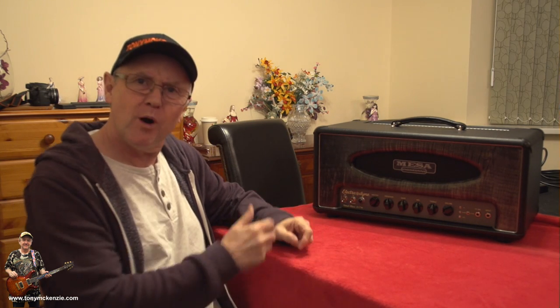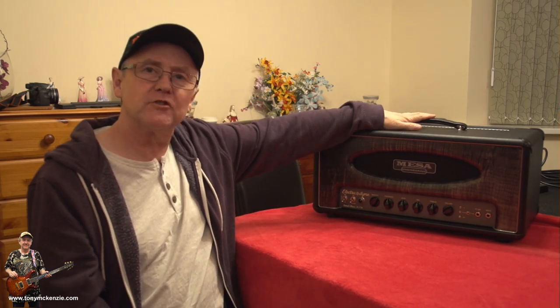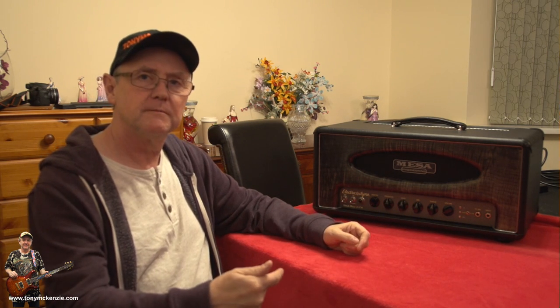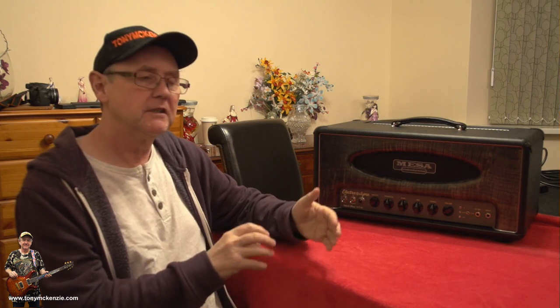So that's a bit of a problem. Why would you bother putting a second potentiometer on if it does the same thing? Well, here's the secret. The secret of the Electra Dyne is that it doesn't do the same thing on the second pot. So when you switch channels, we'll call them, it switches across to the other pot. And the other pot, the second pot, has different results for the same position. That's the easy way.